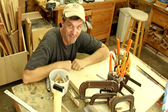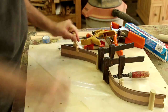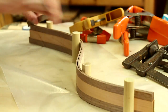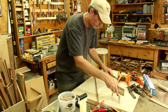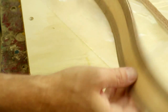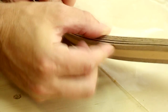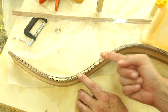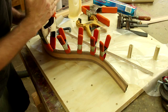That glue-up. The top part looks pretty good. The underside you can see where it didn't quite squeeze together. I'm gonna try to squish some wood glue in those cracks and if that doesn't hold it together I'll have to switch over to some epoxy.